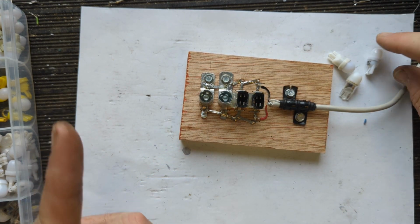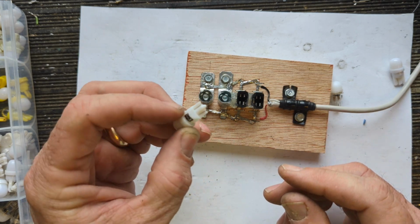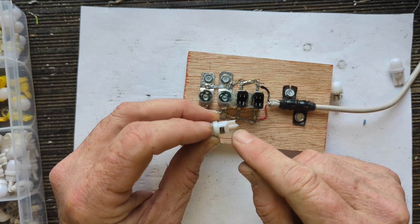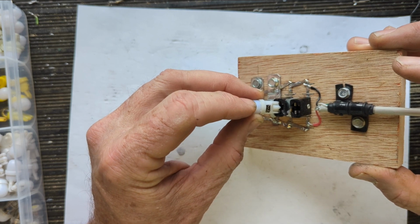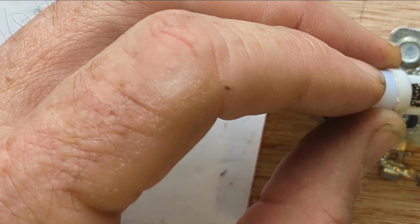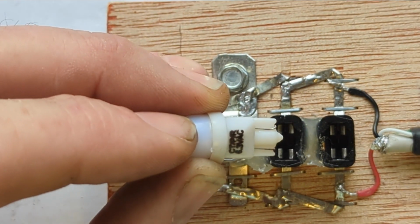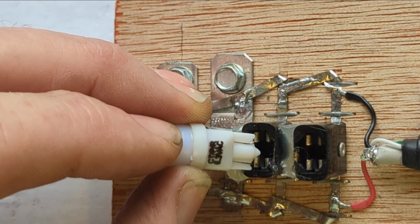By the way, just as a note on these 555 style, a lot of times you plug them in, they won't work, and usually the problem is these wires. It's kind of a design problem, I think. The wires are a little too far inboard. If you look closely, how close those wires are to the center of the electrode. Let me zoom y'all in a little bit. There. All they have to do is just jump a little bit to the inside, and one of them can pop off the electrode, and it's not going to work anymore.